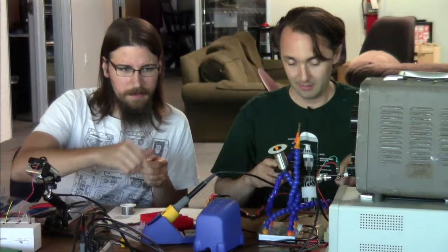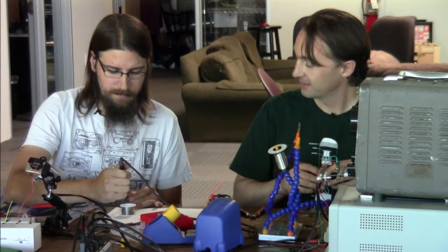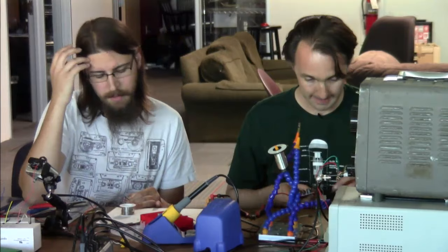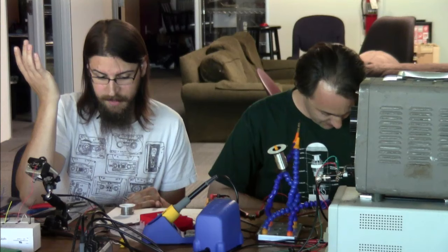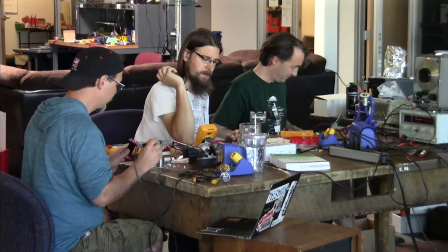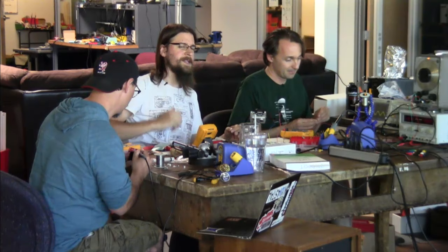Well, if we had the SPICE in front of us, each of those gives us a different knee on the Bode plot. Right. And I've seen it with where all the poles and zeros are, so it definitely has three. And if you equated everything down to a couple of components, it would only have two. So not a very good answer, but it wouldn't quite be the same.